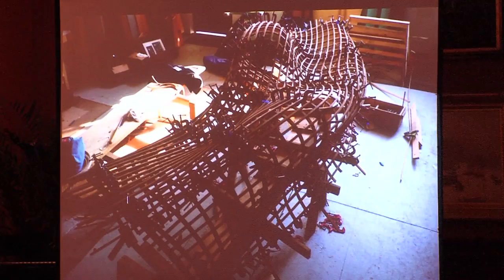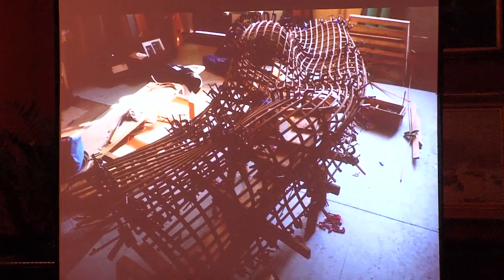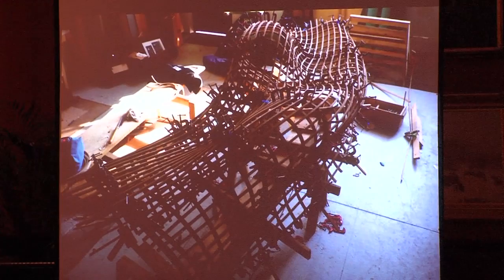This is a really, really complex piece to build. I don't know if you can tell when you look at it down there, but I think I have an internal shot of it in this show. This is a really tight compound curve piece. Most of the bigger scale pieces are easier to build than this one because you have a whole segment where it's pretty easy bends, and then you get some really complex steaming areas where you have to really force the wood in there and really manhandle it for maybe a little section, and then the rest of it's easy again, and it gets maybe tough again.